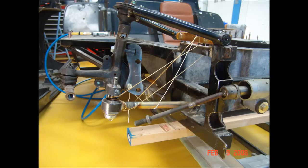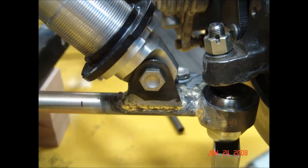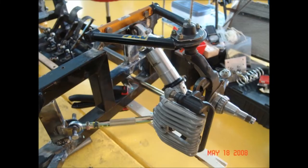This is a mock-up of the front suspension using the Mustang II geometry. The suspension units are coil-overs made by Alden, front and rear. The front uprights are from Ford — a Mustang II forged steel — and the calipers and rotors are from an 88 Corvette. They're nice aluminum calipers made in Australia.